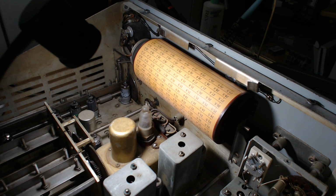It's called a .06 six-sided Bristol, and I think Xcelite makes it. That's the size Bristol that allows you to move the kilohertz dial. I'll show you that in the next video, but I'm trying to show you things that other people don't show you. They skirt right over it, you know.